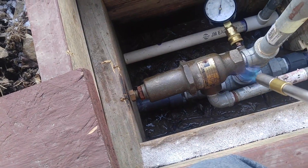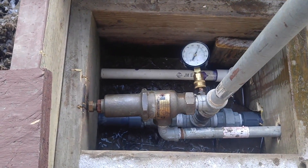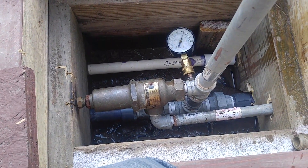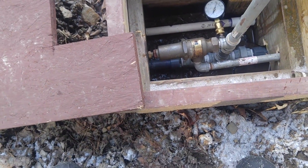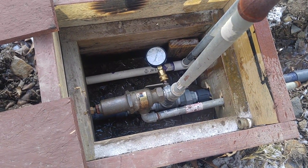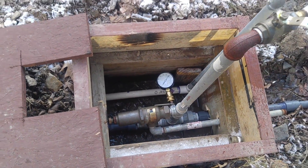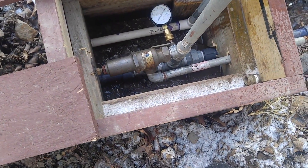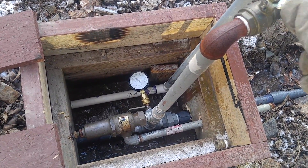The water is just kind of passively flowing through there. It's preset to max out at about 575 psi — just under 600, which is what all of our equipment is rated for. Now that that's open, we're going to start to apply pressure by closing this thing off, and it's going to take a minute because now we're filling the rest of the line and the pressure is going to start to build. We'll close it off all the way — now the unloader valve is basically going to do the rest of the work. We're going to let that piss just a little bit.